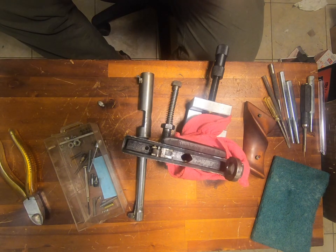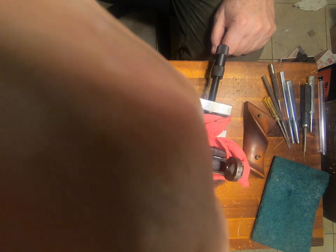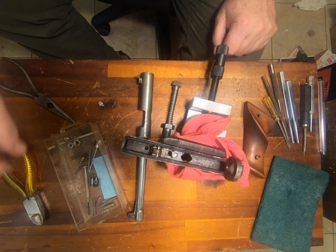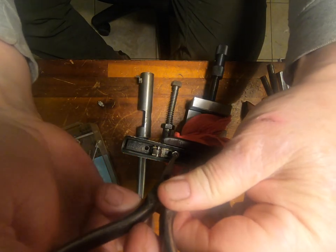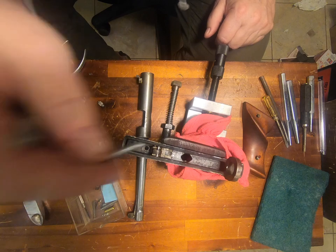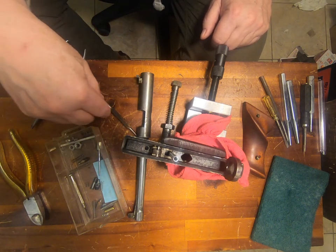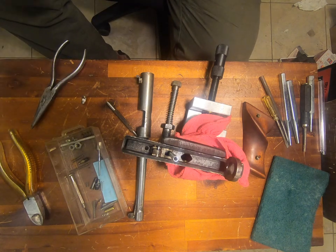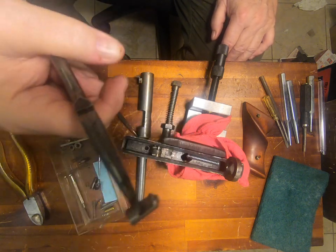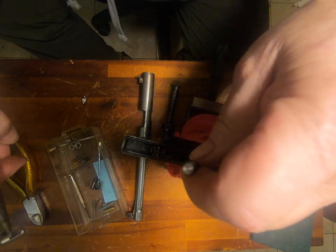This is a mistaken one that I made, so I'll do it upside down so you can see. It goes right in here like this. Ignore that little hole on the top because that's upside down. If you look inside the frame itself, you will notice a hole down here — that is a place to set the spring. I've made about seven or eight sears trying to get this right, and this is my latest attempt, and I think it's the one that will work. It's only slotted on one side, and it's got this little tit on the bottom, and that's the whole idea — to fit inside the end of the spring.